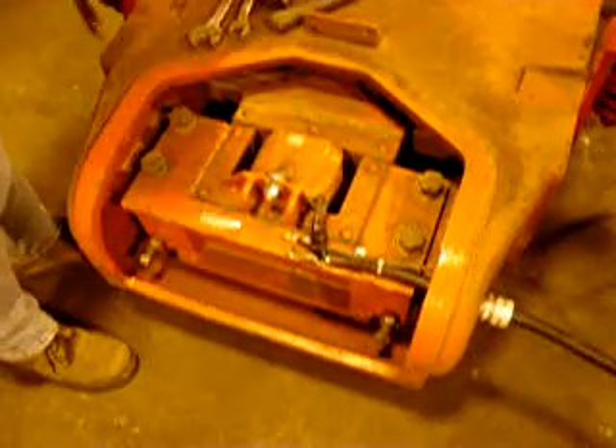This will close the air gap. It makes it easier when adjusting the air gap to open it up. Now, turn each jack screw in about a half a turn each time until the desired air gap is attained. Please refer to the service manual for the correct air gap.